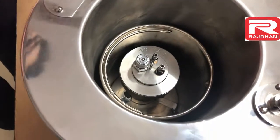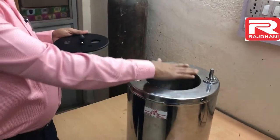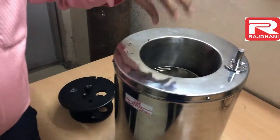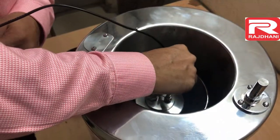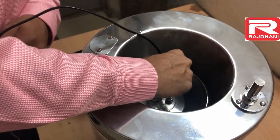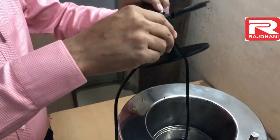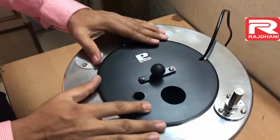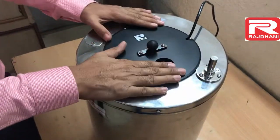The next part is the combined lid. It is called a combined lid because it serves as a lid for the calorimeter vessel, and the upper plate is the lid for the outer jacket. When we keep the bomb inside the calorimeter vessel — with sample inside and filled with oxygen — we will put this electrical lid. There are electrical terminals on the bomb and there is a slot for this electrical lid. This bigger slot is for the electrical lid, and there is a small slot for this pin. This way the combined lid is fixed — it is fixed from this pin, and this part is supporting the combined lid.